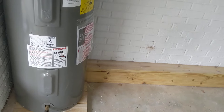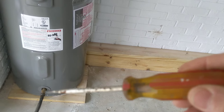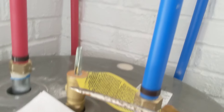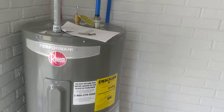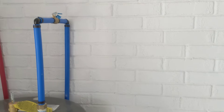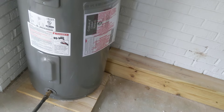If you're going to flush your water heater — which you need to do every so often — you hook up a hose just like we did and open the drain valve. Leave the water supply on. Don't open the relief valve. Don't open the spigot outside. Don't turn the faucet on inside. Don't open the valves on the washer box. Just connect the hose, open the drain, and let it roll. That's it.